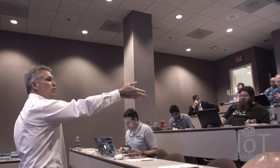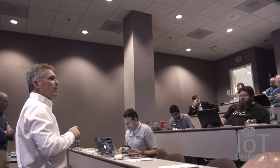The peripheral comes up and it says, hey, I'm a so-and-so. And the central goes, I don't know what that is, tell me. The first thing he says is let's connect. The peripheral says, let's connect, and I want to talk like this. And the central goes, oh no, you're going to talk like this. So you might have the thing saying, I want to be at 7.5 milliseconds, and I want to talk to you that fast. And the iPhone goes, nope, 10 is the fastest I'll do.